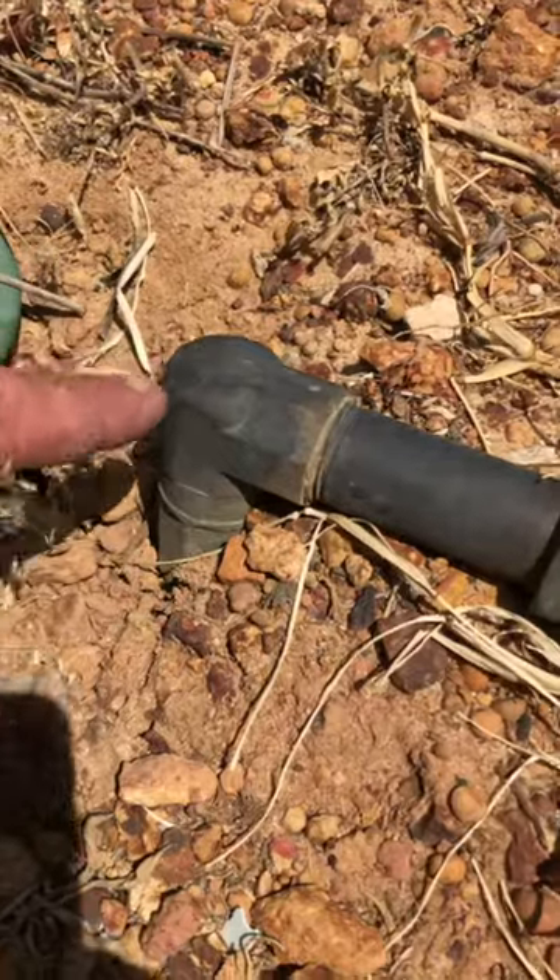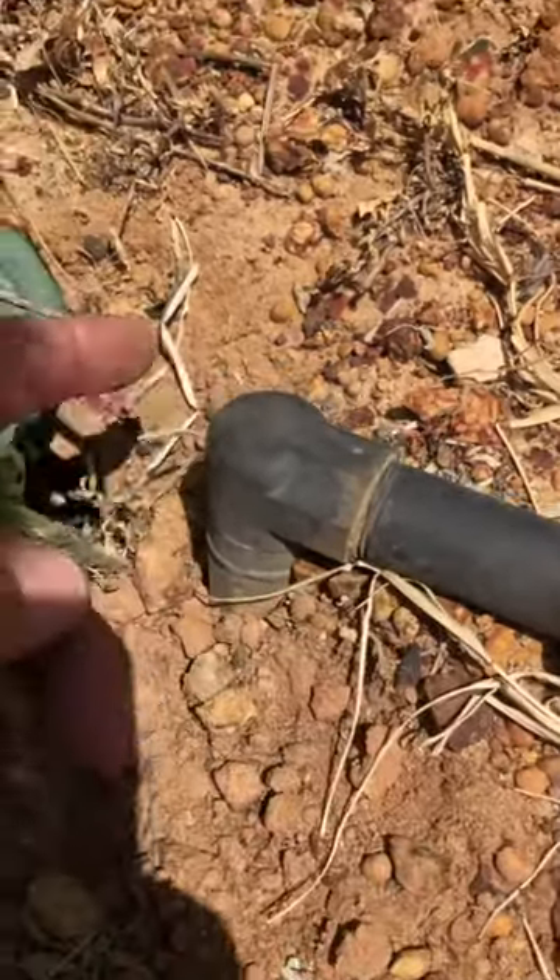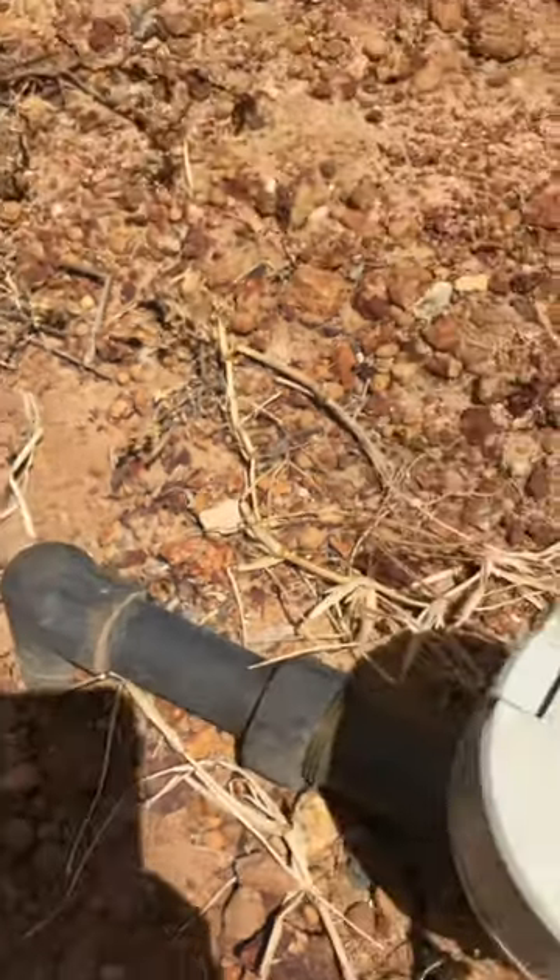Now, if you've got one that looks like this, this is the AVG model. If you've got one of those on your water meter, there's a good chance if it's a couple of years old it's stuffed, like this house here — taps are leaking all the time. You look at the water meter and think it's got a pressure limiting valve, but it doesn't work anymore. We've tested the pressure and it's like 900 kPa.